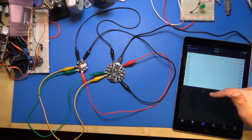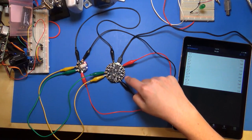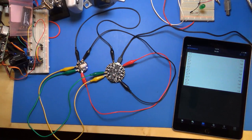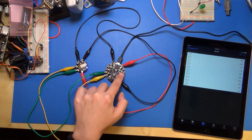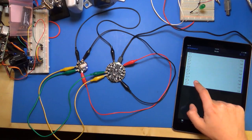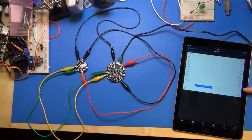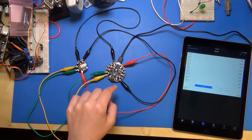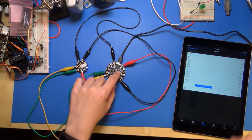This gives you a list of all the pins, which most of those pins are the outputs on the side of the board, but some of them are pins that control the components on the board. For example, pin number 4 or pin number 19, these are the pins that are connected to the push buttons on Circuit Playground. And if you look, pin 19 right here says it's set as an input and it's at a low level right now. That's because the way these push buttons work on Circuit Playground, when they're not pressed, they stay at a low level, and when they're pressed, they go up to a high level.